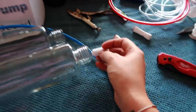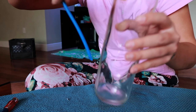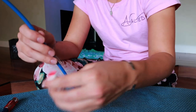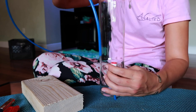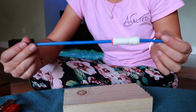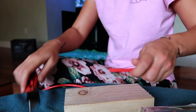What we can do in the meantime is make our tubing length for the inside and do the check valves. Check out how the bottom of the tube is cut at 45 degrees - when it sits on the bottom of the bottle, if it's flat it won't suck everything up and will get air. We want to do a few inches to go into this check valve, nice and locked in there. Then it's going to go from the bottom into the check valve. Now let's do the calcium one.